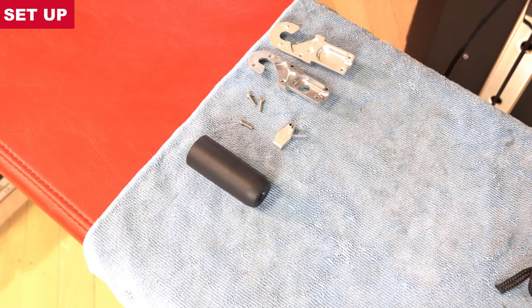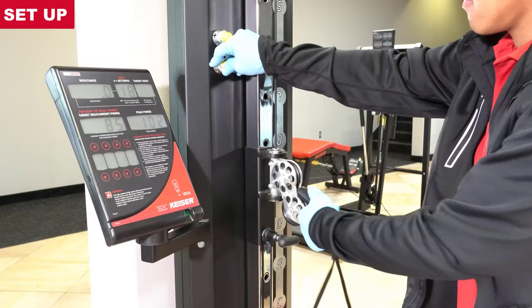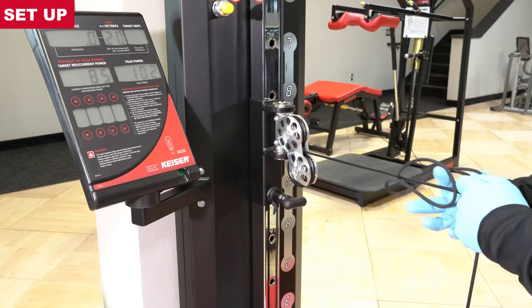Before servicing the machine, disconnect the air supply. Remove all air pressure from the machine until there is no resistance on the rope. Extend the rope while pressing the negative thumb button to release any residual air pressure. Now, extend enough rope for service and tie a knot at the pulley to secure in place.